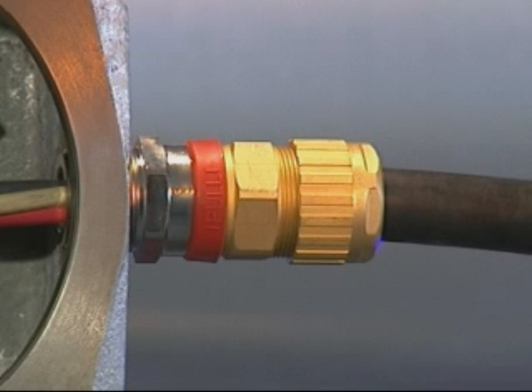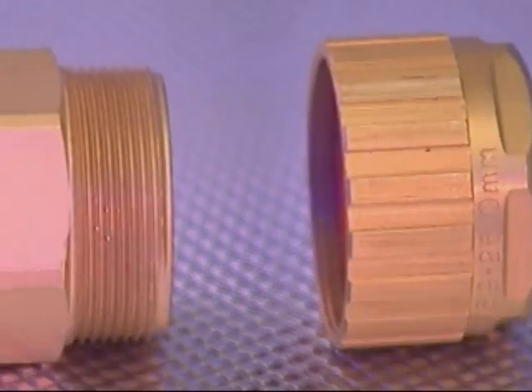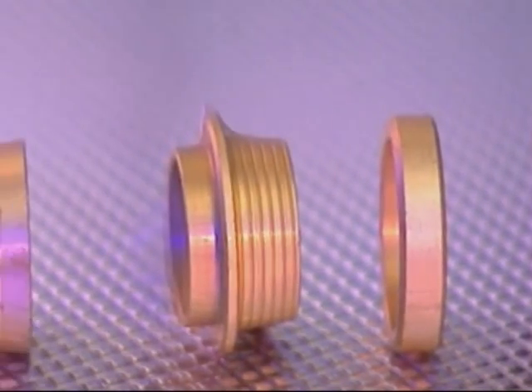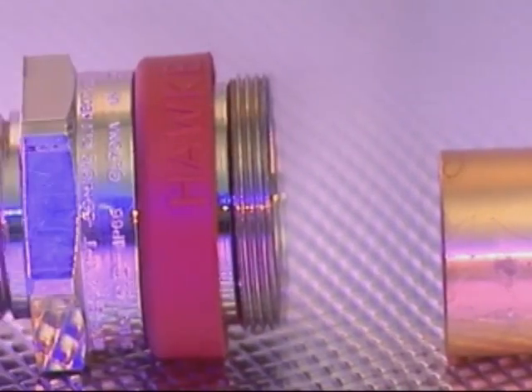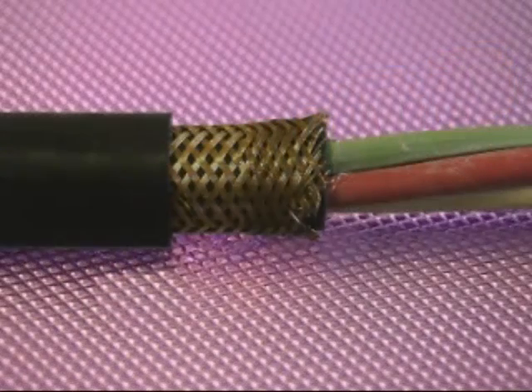753, 755 and 710 cable glands. The 753 cable gland comprises six major components, these being the back nut, middle nut, clamping ring, spigot, brass pot and entry component complete with red deluge seal. This gland is suitable for use with armoured marine shipboard, jacketed and non-jacketed cables for Class 1 Division 1 locations offshore.